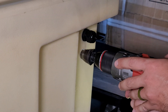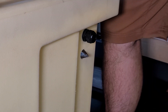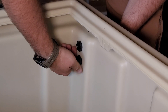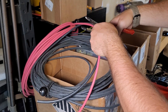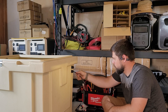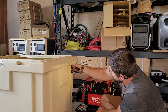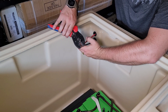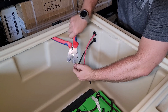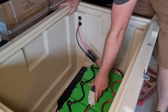The box enclosure is a dock-rated box and this is mostly going to be powering Starlink on a dock out on a lake. I'm using wire glands from Amazon to allow a watertight connection so the solar wires can go through into the box. This is PV wire — you do not want to use welding wire or THHN wire, which are common at hardware stores. You specifically want PV wire because it's outdoor rated, meant to be in the sun or in contact with water and the ground for 25 years without the sheathing breaking down. These MC4 connectors are really easy to work with and I highly recommend them. I'm using them with a DC switch so I have control over the solar input.